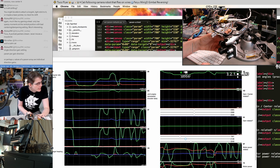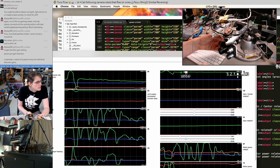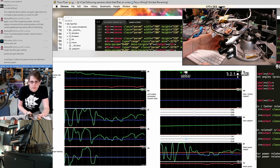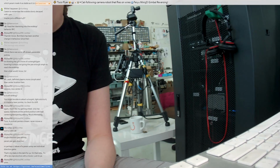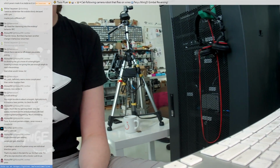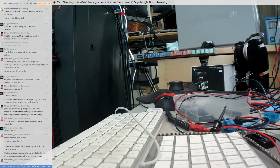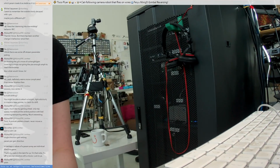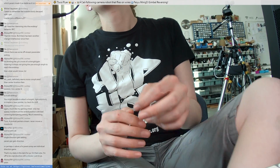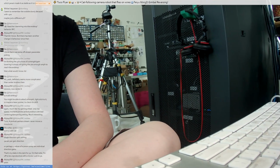Yeah, this maybe isn't a gain. Maybe this is some kind of phase offset for the motors. Because it feels like maybe I'm having the effect of decreasing the gain, but maybe what I'm doing is decreasing the motor efficiency. I bet this parameter is motor related. I bet this is a calibration for the motor, the offset between the motor phases and the magnetic encoder or something like that. Yeah, maybe the thing that's calibrated at factory isn't the gain at all. Maybe the thing that's calibrated is mechanical parameters of the sensors.